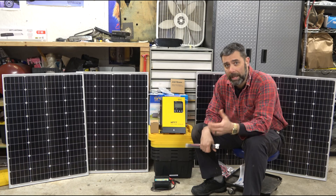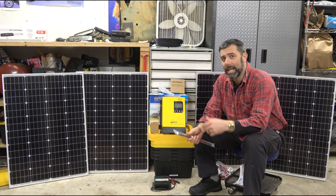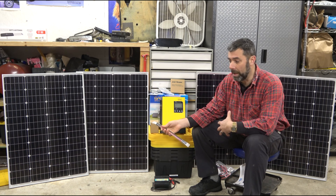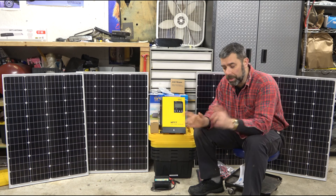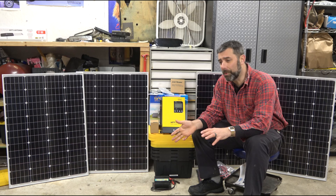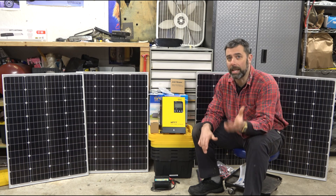Batteries — that is where the big hangup is right now. I'm still struggling to come up with money to buy what I need without wasting money over and over again. I'm looking to get a lithium-ion battery in the five-kilowatt range to start, eventually wanting about 25 kilowatts of stored energy because we get a lot of cloudy days up here. For now I've purchased just a few lead-acid batteries to get started — they have a shelf life of three to five years in the cold here, so I don't want to spend too much on those.